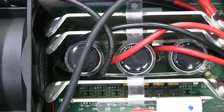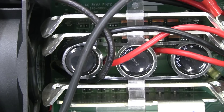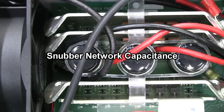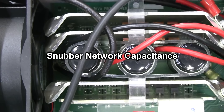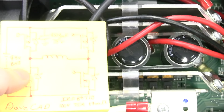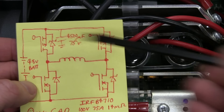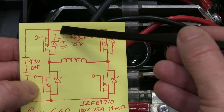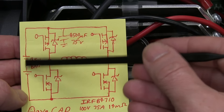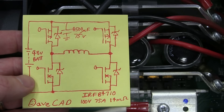What we've got is four International Rectifier IRFB4710 power MOSFETs — 100 volt, 75 amp rated, 14 milliohm on-resistance — and they're clearly paralleling four of those up with room for another four. So the 3300 watt model would have fully populated power MOSFETs. They're tapped into holes directly on the heatsink, which is also used as the main current carrier. There are two with P-channel MOSFETs and two with matching N-channel MOSFETs. I don't see any huge power diodes sharing the heatsinks — just some caps down in there. So they must be doing exactly what I said: using the substrate diodes reverse-biased to rectify the AC coming back from the output transformer, filtering that, and charging the battery from that.